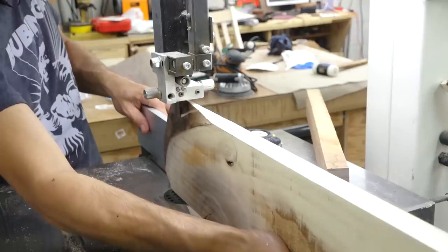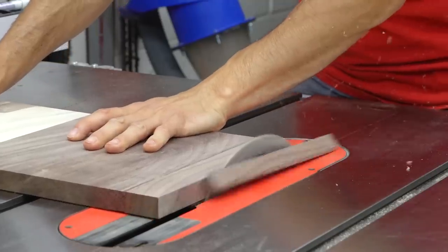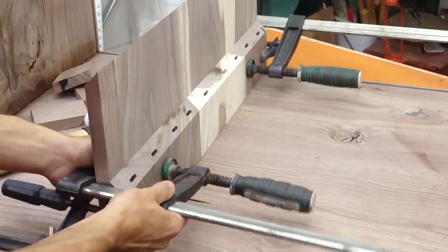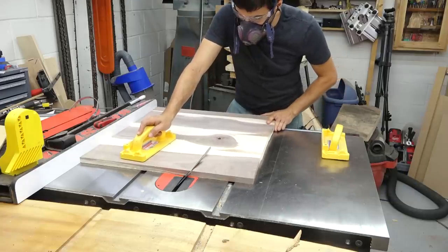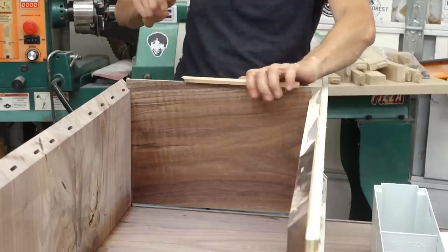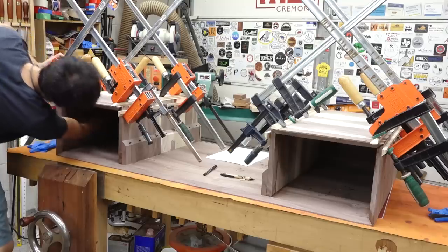While that cures, I'll make some stock for the back panels — these will be quarter-inch thick captive panels, and I'll go ahead and finish them now. Next, I can run through the process of making the sides for the middle drawer compartment; the process is the same as the ones I just added and they'll just get glued to the taller dividers. Now for some bottoms — checking for accuracy as I go. I'll make the bevel cuts on each so it fits between the vertical components. Some dominoes and cauls, and we're just about ready for another glue-up. But before I forget, I'll cut and install the back panels. To get the bottom panels to drop in with the protruding dominoes, I'll use some clamps to pull the verticals over a bit, widen the top enough for the dominoes to drop in — and a bajillion clamps on the cauls, and these case bottoms are all set.